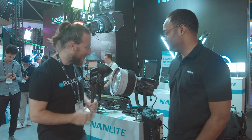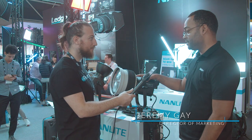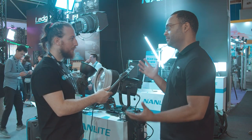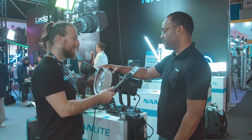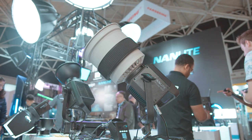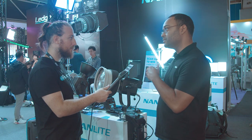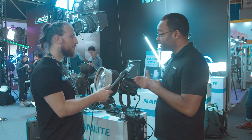Jeremy, what's up? So, a 500-watt LED — this is the Forza 500. It is our flagship light in the Forza series. We have a huge Bowens mount and our new Fresnel with a 10-inch lens. Bowens, the manufacturer that used to make strobes — I don't even think they ever had a 10-inch Fresnel. You'd be hard-pressed to find a 10-inch Fresnel in anything but a giant HMI type of light. 500 watts of LED power — it's the equivalent of a 575 HMI. On the flood side, it actually blows it away; it's much brighter than an HMI. On the spot side, it's pretty close. You give a slight edge to the 575, but a 575 goes down to 6 degrees — this is a 10 degree — but it's pretty close.